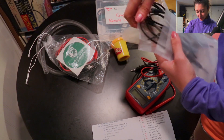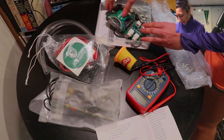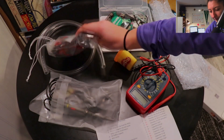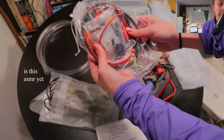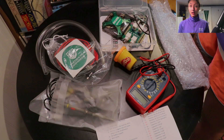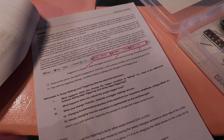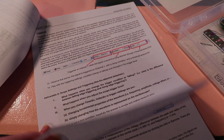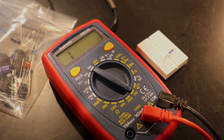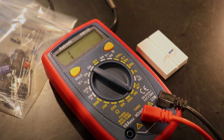Looks like we're gonna do some circuitry — I hate that. So the purpose of this lab is to get comfortable with oscilloscope operations. We're beginning to transition from those mathematical representations to the actual physical operations. This is the packet with all the information, the how-to and the setup for the lab, and it's like magic. First thing I need for this lab is a 47.5 ohm resistor. Pretty sure I have the correct one picked out from the colors, but I'm gonna use this digital multimeter just to check really quickly.